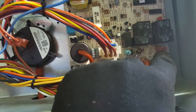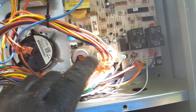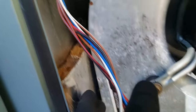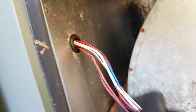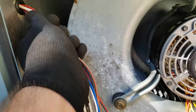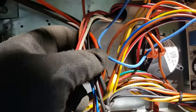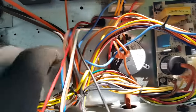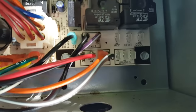Now we're going over to the board because we're going to use the heat tap and cool tap to power our blower, and take our other side from the other line of power. I took all my wires and put them through a new grommet — I get these from Harbor Freight, they come in real handy. I'll leave a little bit of slack so I can strap it along with those limit wires. I'm going to come around the other side and pull them out. All of our wires are here — even the capacitor wires. I'll mount the capacitor right here so all the controls are in the same spot.